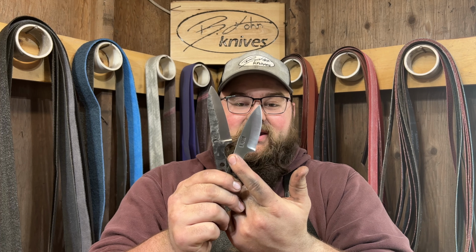I'm going to go ahead and get both of these etched in the acid and then dunked in coffee overnight to really darken the steel and make sure that it is super dark, so that when I put it in the tumbler, it's going to make that really cool acid wash finish. So I'm going to go ahead and dunk them in the acid.